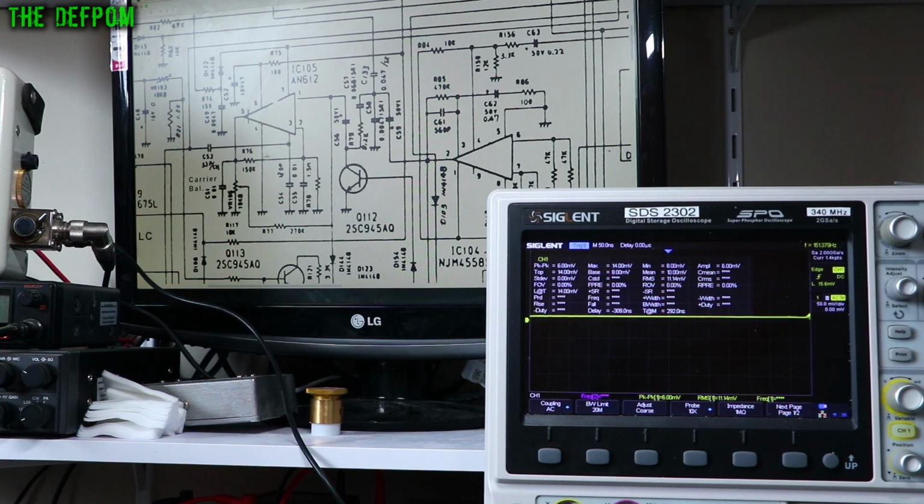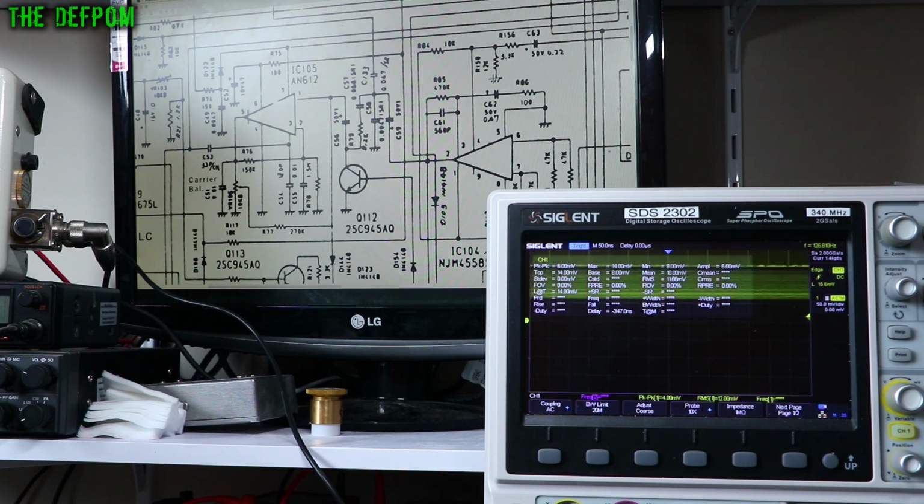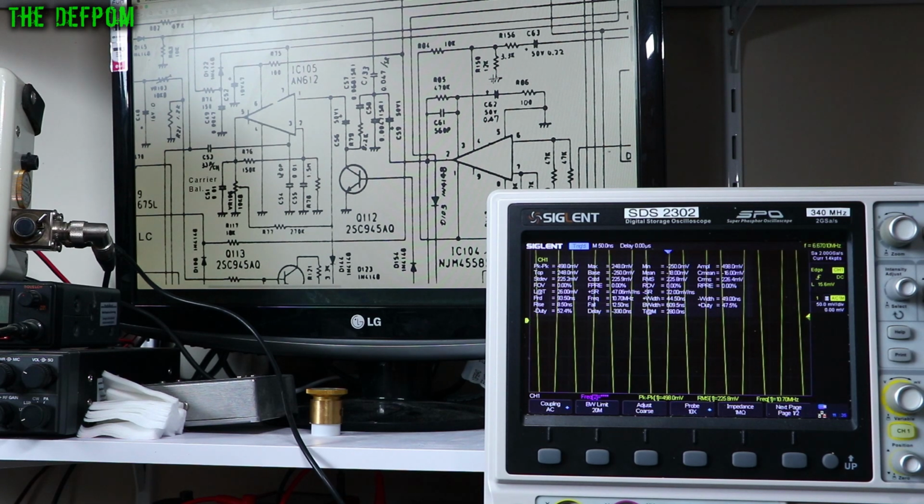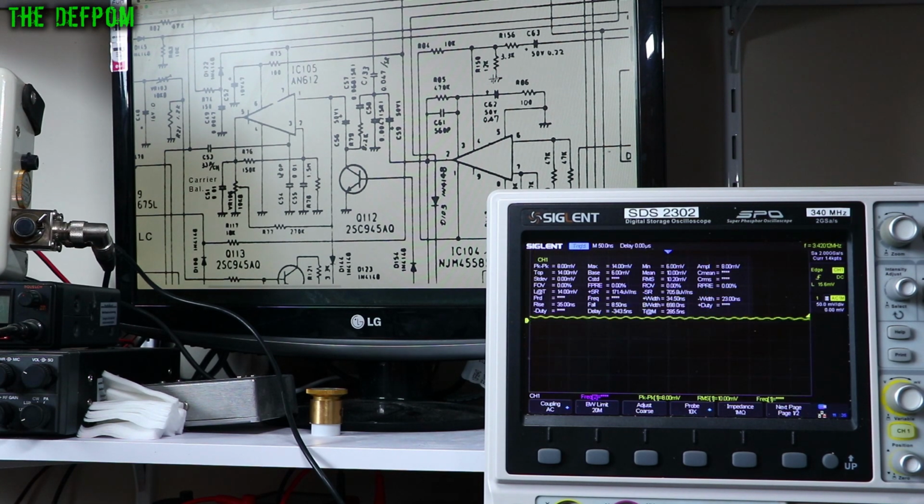So now moving on to the balanced modulator and just checking the IFs in and out. The IF comes in here to the balanced modulator. Modulation comes in this way, and this is a switch and stuff like that for the modulation modes. And IF should come back out of here. So if I probe on D122, you'll see on the scope in a second, you can see the IF's coming out. D122 is right there. I'm going to transmit. So there's the FM. AM's got nothing there.